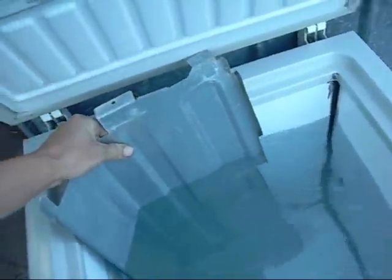Your anode plates, sacrificial anode plates, can be anything. Galvanized steel isn't too bad. The zinc does turn to oxide immediately. Never use stainless steel, though. You do end up with a solution of hexavalent chromium afterwards, and it is highly toxic to the human body. It's classed as a hazardous waste by the EPA, and you get into massive trouble for dumping it. I mean, you pretty much have to call in a hazmat crew to get rid of it. So never ever use stainless steel as a sacrificial anode.